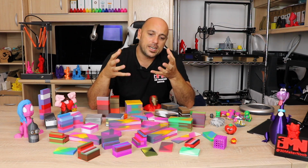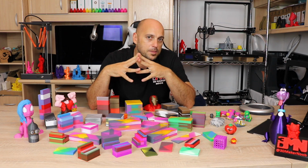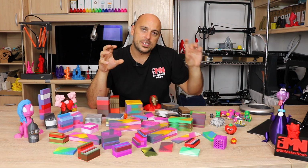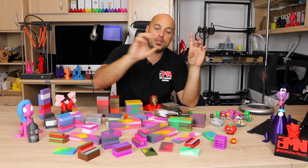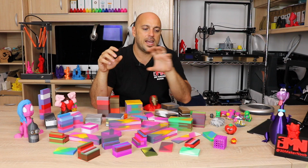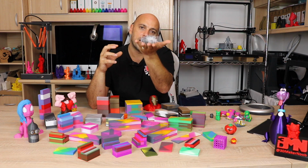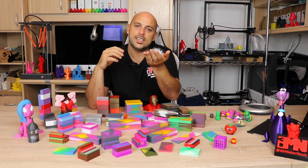To give you an idea, I have the R17 Sigma, and that is an independent dual extruder. So what it does is it purges a little bit of material, starts printing, moves the nozzle away, brings out the other nozzle, and starts printing with the other one, and keeps on going like that. Every time it is about to start printing, it just purges a little bit into a bucket, resulting in something like this. This was used to print a Moai head in dual color.